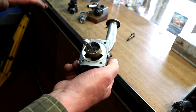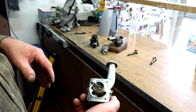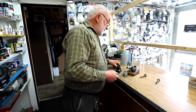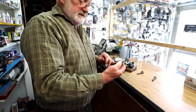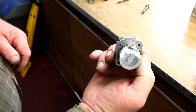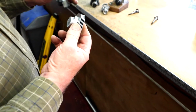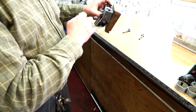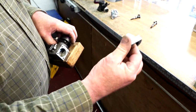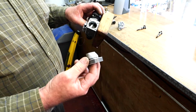Instead of it having to come up to go round, you can take it straight from the crankcase up. And that gives you oodles more horsepower. And then where it does come into the back plate, you can do a Leary back plate like that. Does that boost it more? No, it just takes that transfer port down lower, so it picks up better. But again, it's got a backplate cooler to keep the volumetric efficiency up.